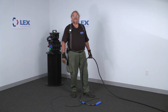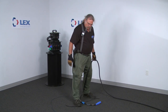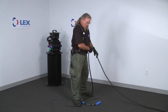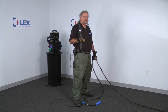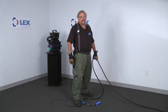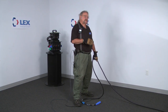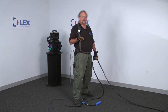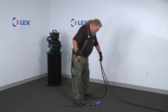If you've got a piece that has a set to it, sometimes you can put a foot on one of the ties to get you started, because as you're pulling on it, it will tend to try to untwist. We want to put a half twist in the direction of the lay of the cable — that should be clockwise in the United States, that's how cable is made. If you look at a piece of stripped cable, you'll see a natural lay, much like a piece of rope.